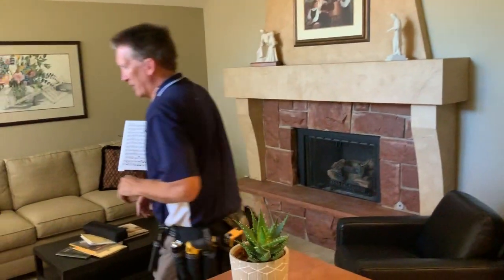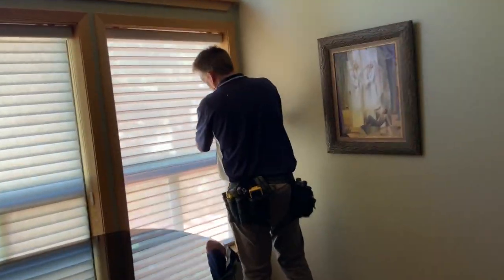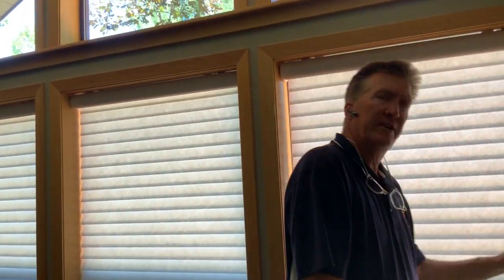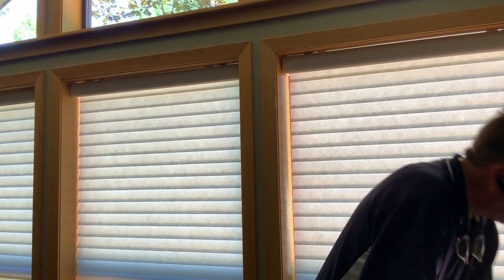So as we come here, let me show you. Did they get to see this in person? Yeah. If you look here at the lower corners, part of that is due to the frame sweating. Part of it is due to moisture getting blown through, because of poor caulking at the joints around the windows and at the joints in the aluminum framing. Now, when I get to some of the windows that aren't being hit by sprinklers or heavy wind-driven rain, there's none of that. We have a few windows with none of this, but a majority of the windows have that to some degree.